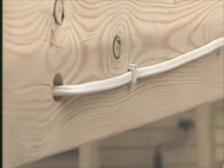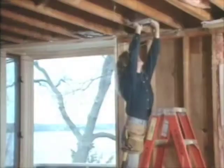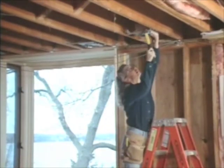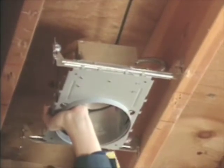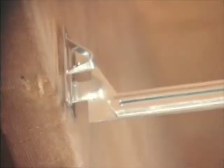This is another situation where the cable needs to be supported at least every 4.5 feet. Recessed lights like this generally hang between two ceiling joists, suspended from a metal bar nailed or screwed into the bottom of the joist. They don't require a separate electrical box because they come with an attached metallic box where you make the electrical connections.